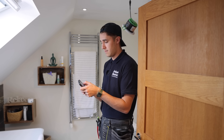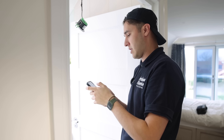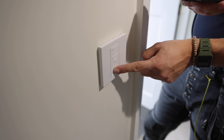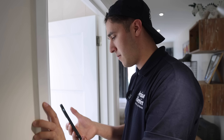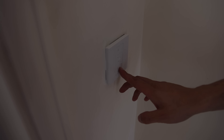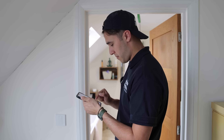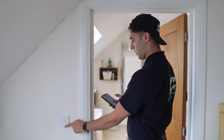So these are flashing — I'll just add these. Master bedroom toilet ceiling lights main. Add another device — we'll add another 240 volt dimmer. So they're flashing now, so I'll add that and we'll call that 'upstairs bedroom bathroom' — and that's those added. Now I'm going to add these Pico remotes and I'll program them for 10 seconds until the LED blinks quickly. So now we'll assign that to upstairs bedroom bathroom — once that's added, we'll assign it to do the lights. Another Pico remote — hold this down for 10 seconds. I'm going to assign that to bedroom upstairs bedroom. We'll add another device — I'm going to assign that to bathroom, master bedroom toilet. And then that should just control it once it's finished its setup.